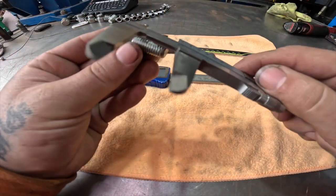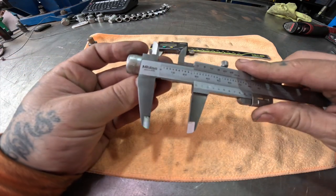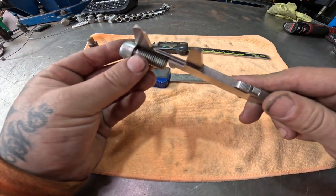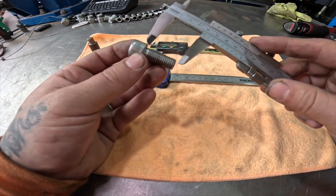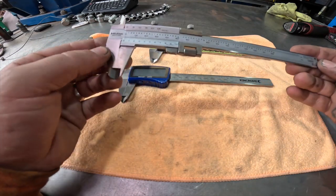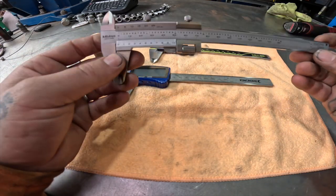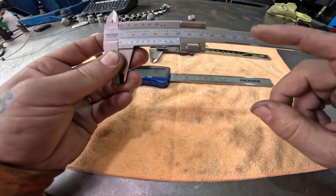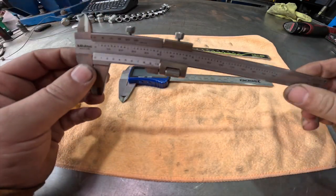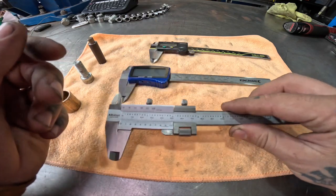You can also do shoulder dimensions — you can see that little piece up against the end, then your face, and then you get your reading here. The zero lines up with the 30, which means there's 30 millimetres from the underside of that shoulder all the way to the end. Almost an absolute necessity for building bikes, or even just modifying stuff so you can remake the part you need longer, or even just measure out a part that you need somebody else to make for you. A cheap version of these will do that a thousand times over a small ruler you found in your pencil case.